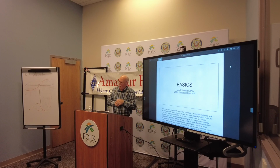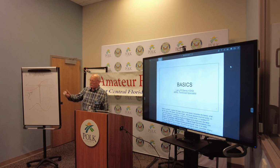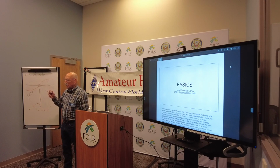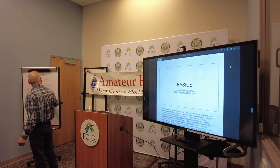What other forms of dipoles are there? There's all sorts. Everything from off-center fed, three halves wave off-center fed, and full wave dipole, which is a high impedance monster. Or like an end-fed half wave, right? But by moving the feed point, you're just transforming the impedance. Right, because you're feeding it over here.